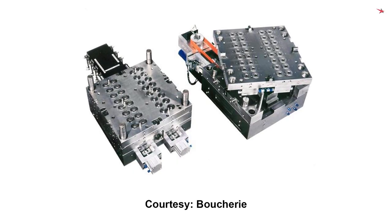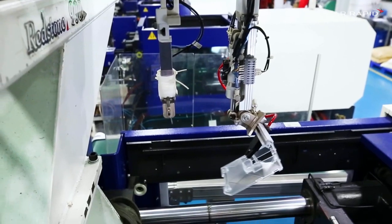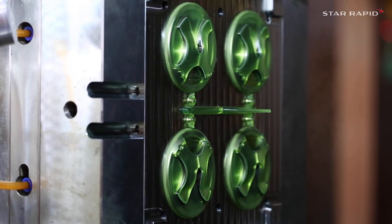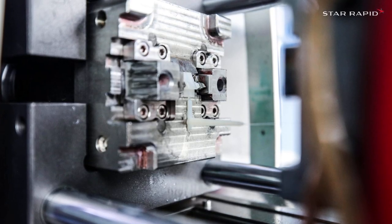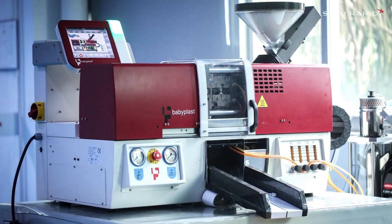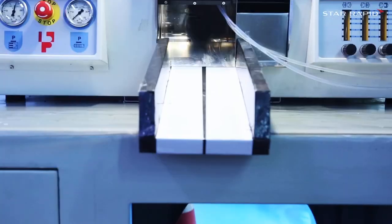Also, there is a limit to how small a mold can be in a 60 ton press due to the pressures involved. If you're making a mold with many cavities, maybe 32 or 64 cavities, then it's perfectly fine having a multi-cavity mold in a larger press. But here at STAR Rapid, we specialize in low quantity molding, typically no more than 100,000 units per year, so we don't usually produce molds with more than 2 or 4 cavities. With tiny parts, even a 4 cavity tool might only need a tool that is about 105 millimeters or around 4 and 1/8 inches square, which happens to be the size of our Babyplast molds. So when you're next thinking about where to get some very small parts made, please consider a Babyplast.